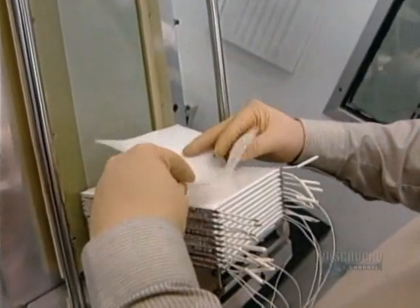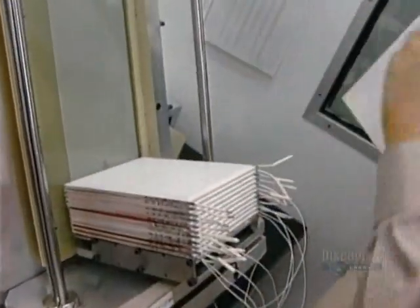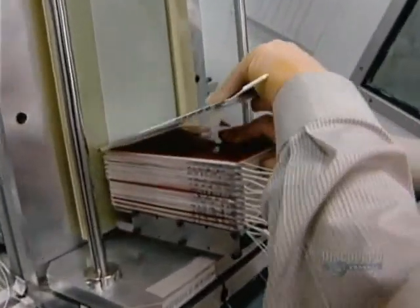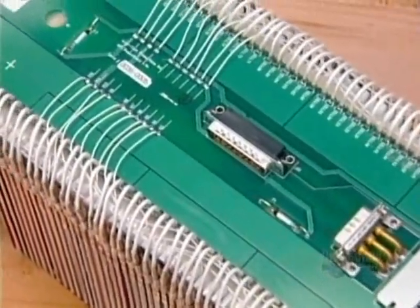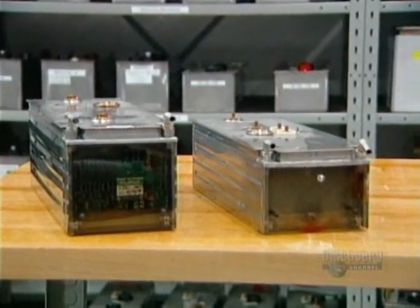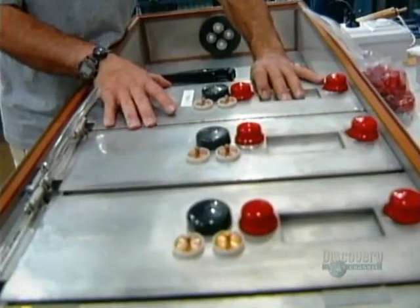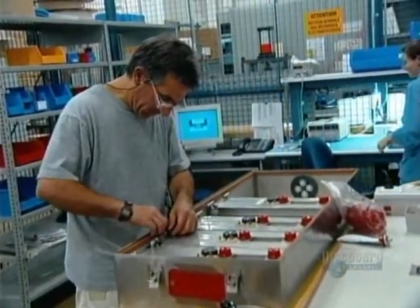All that remains is assembling the individual battery cells into a module. It begins with placing individual cells onto one another and isolating them with foam so they don't touch each other. The red sheets are actually heating elements, since the lithium metal polymer cells function at temperatures of between 40 and 80 degrees centigrade. All individual battery cells of the completed module are connected to an electronic card located above the module. The finished modules are connected in series and in parallel to form a battery pack, which can be used in an electric automobile or a hybrid vehicle.